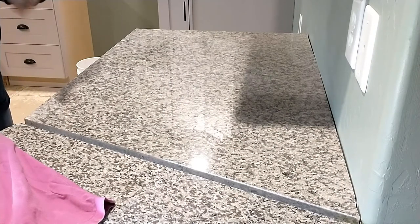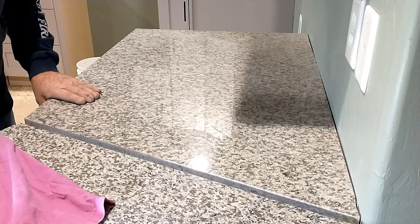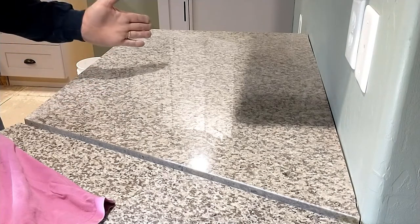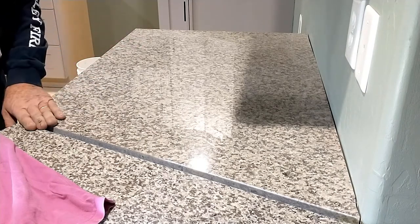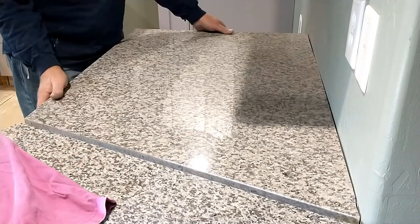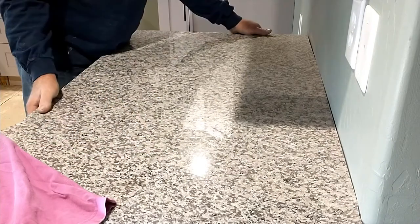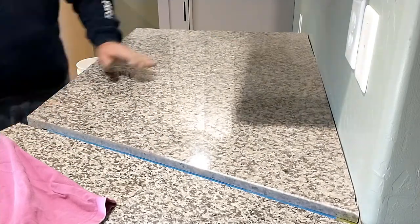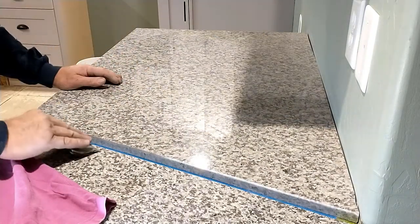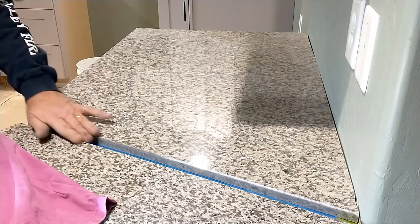Okay, I wanted to just make another entry on our house building project. We're doing granite countertops and I want to do an overview. What I'm going to do right here is a seam fill, glue the seam together. I've leveled the tops up so that when they're together, they're really level. Now we're ready to epoxy them together, and I've sanded the edges just a little bit, just broke them so that they're smooth.